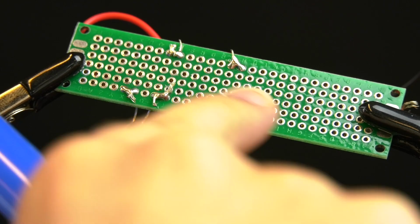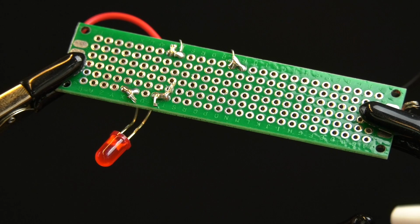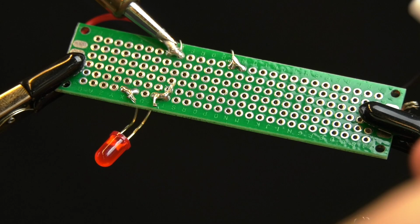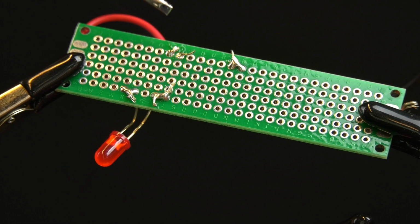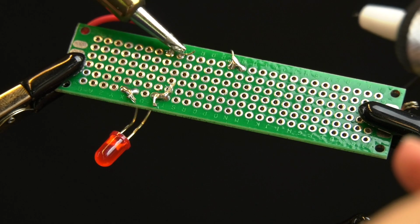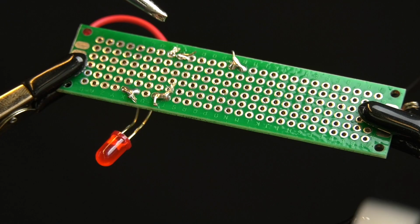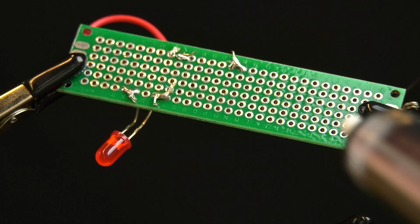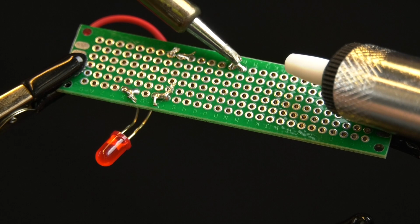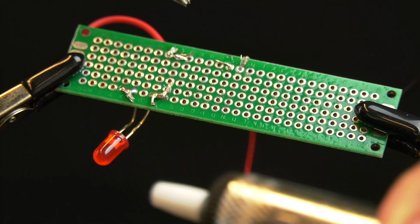So we're gonna start by heating up these two points with the soldering iron, and then we're going to first try sucking the liquid solder once it melts with the solder sucker. And there, got some there. And it just sort of pops it out when it's dried or cooled. Suck some more out there. Pop it out. And we melt the solder with the soldering iron and then sucked it right out.